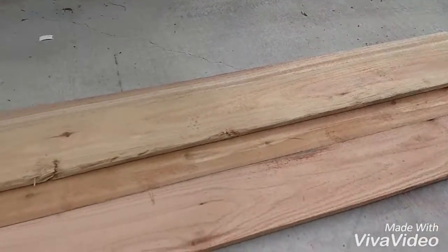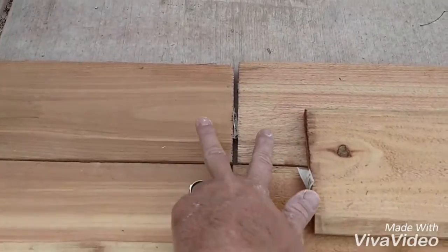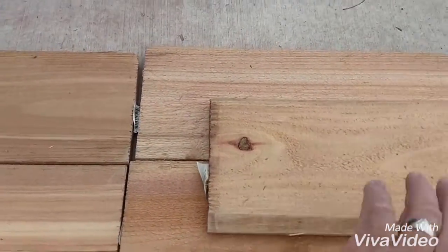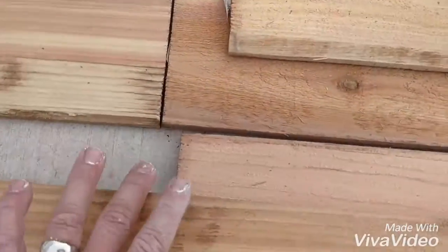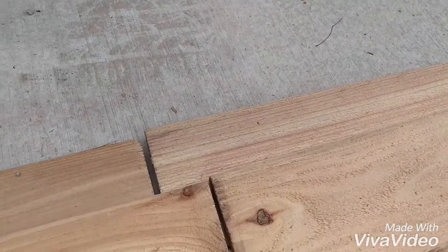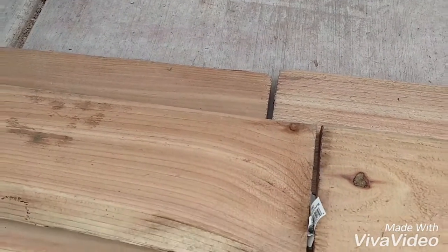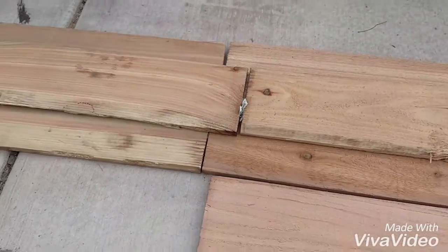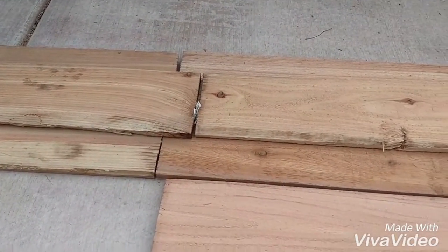This barn door is just made out of fence planks. I lay them out like this — make sure these are lined up together. Then you overlap it, but you stagger it about half the width of one of these boards. That way you can overlap, and then later you put a trim piece right down there to cover the joint and strengthen it up a bit. Wood glue everything and then just use one inch finish nails, brad nailers.